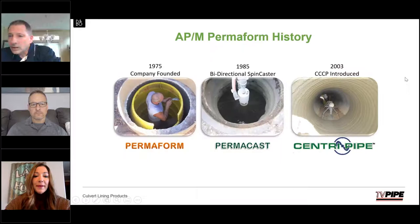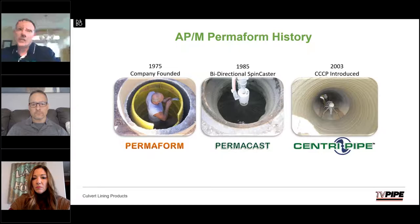A question came in: what is the Manning's n factor of CentraPipe? The Manning's n factor is going to be somewhere between 0.017 and 0.022 — it's like an eggshell finish. It's not as smooth as you'd find in an HDPE situation. There's kind of a trade-off: if you're doing a CIP, CIPP, or HDPE liner, your Manning's n is probably going to improve due to the surface of the structure. But at the end of the day, we trade off on that by not eliminating as much hydraulic capacity. That's where we're at.